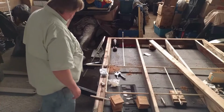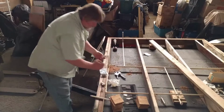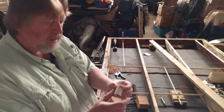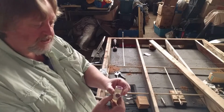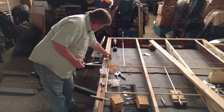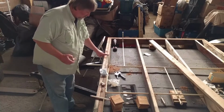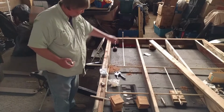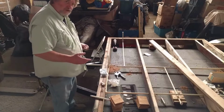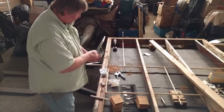It'll work just fine. So what I'm trying to do here is put this T. This is the 3/4 inch water line, and it has a 1/2 inch T on it. And this T is going to go in here and stub up like this one. And this will be my cold water line. This is my hot water line running all the way back to where the water heater is going to be. That's the cold water line for the toilet over there. I'll show you the rest of it here in just a second. Then I'm going to show you how I'm going to test it.